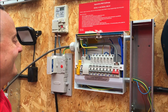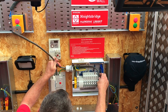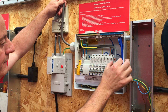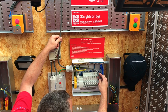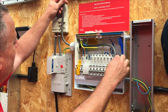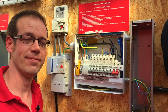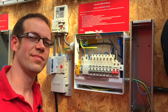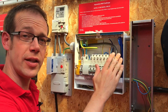It's a blisteringly hot day in the van and the cable is slightly more malleable for that, but that looked like bending chocolate - unbelievable. Just a couple of fingers to make that bend - wow. It's really just a case of removing the appropriate amount of PVC insulation to connect the conductors. Just a couple of fingers, easily bent, pop it in one side and the other - that was not a difficult task at all. When I used my knife to remove the PVC it's jam-packed full of French chalk, so stripping was also effortless.